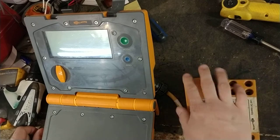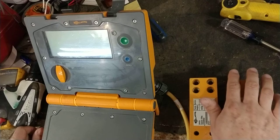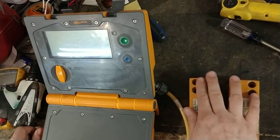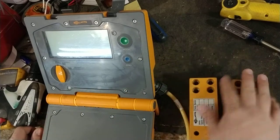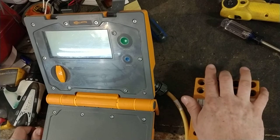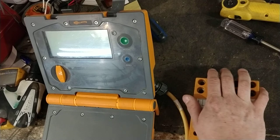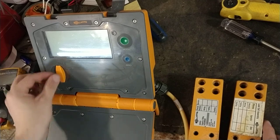Once you've identified the bad bar, you can take it apart and send us just the load cells and cable — that saves a lot on shipping. Or if you don't want to deal with that, just send the whole load bar. If it's a Gallagher setup, we've got a scale here we use for testing load bars. If you send your load bar along with your scale and it needs calibration, we don't charge anything extra for that. If it reads fine, we won't bother with calibration. Go to cattlescalerepair.com — there's a link in the description. Until the next video, we'll see you later.